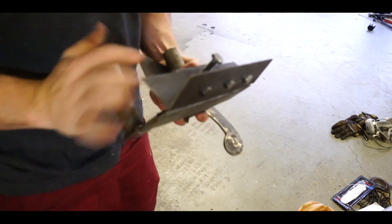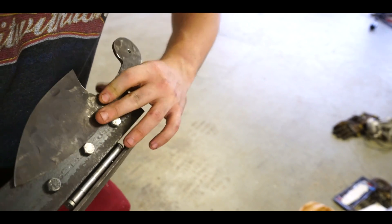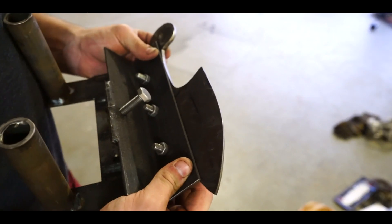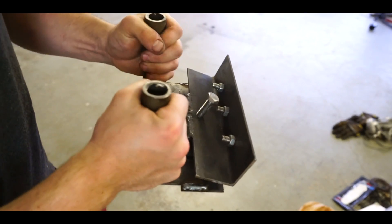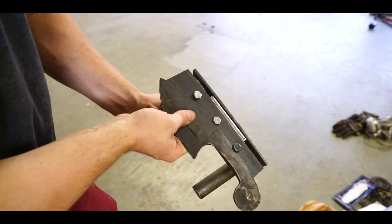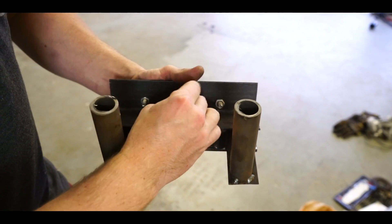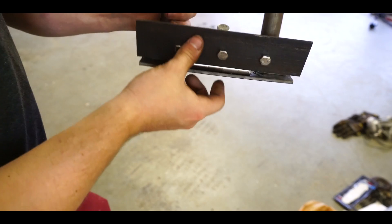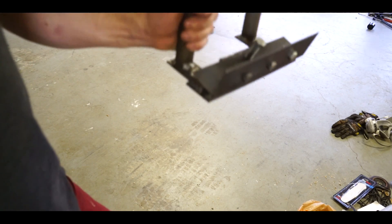I copied another YouTuber's video and made a knife jig similar to his, and I don't know how effective it's going to be on this particular knife, but I might give it a whirl and see if it works. It's just such a strange angle. I'll leave a link to this guy's video — I changed it up a little bit and added my own handle. You clamp the knife to it like this and then run it against a belt sander. As you turn this bolt up and down — it's threaded — you can set your angle that way, and it's on a hinge. By turning this bolt higher or lower, you can adjust the angle. I'm going to try this — if it doesn't work, I'll just sharpen it by hand.